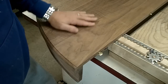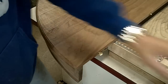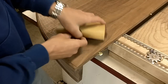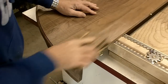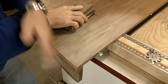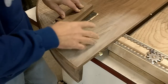I've already put a coat of the Crystalac on here. That leaves a very fine film. It's still a little rough, so what I have to do now is sand that off. I'm going to do that with 220. I've got a sanding block here. I'm going to cover it with a Scotch-Brite pad and then some 220 paper and just sand it until it's nice and smooth. I'll get rid of any excess with compressed air and then go over it with the vacuum. Then I'll put another coat on.